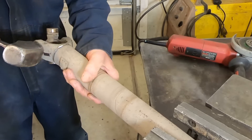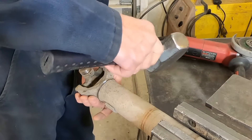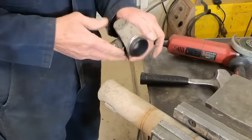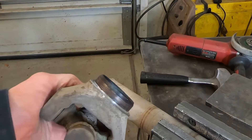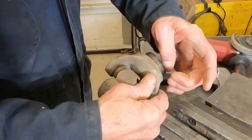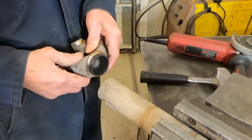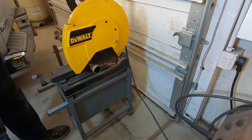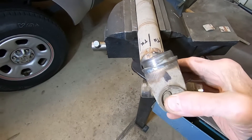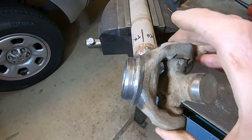I can see a little crack forming — perfect. Now I'll take a file and just clean a little bit up around that corner edge, and I can cut 7 eighths of an inch off of here, push this back in there, and weld it. I've got this all deburred and this piece ready to go. I took a file and cleaned it down right in the corner there, any material that needed to come out. So this is ready to go in.